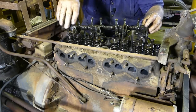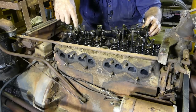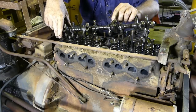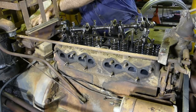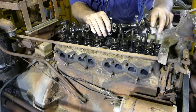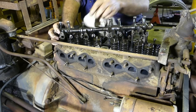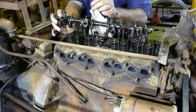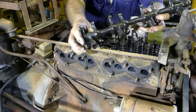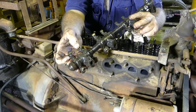There's our rocker. There's a little hole at the back there — that's how the oil comes up through the cylinder head and lubricates the rockers. Another thing we look for: over the years with these rockers hitting on the valves, sometimes they get quite dished inside here. That can be another reason for very loose valve clearances with old dirty oil. Those back two aren't the best, but we'll radius them up — they'll be fine when we put them back together.